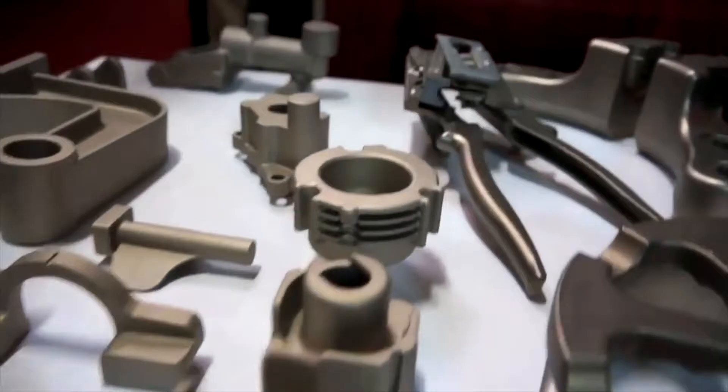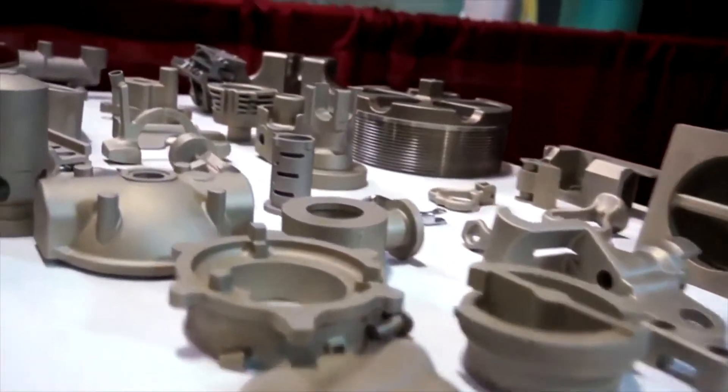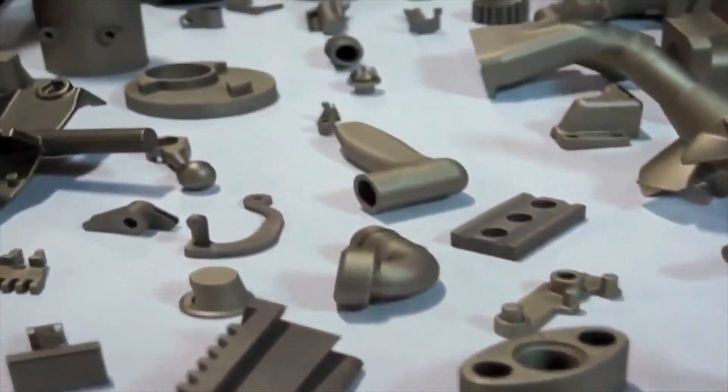We get much more detailed, closer tolerances and better finishes than sand casters get. It's a ceramic mold we're starting with. The first coat of ceramic that we put onto the part is a very fine detail — it picks up all the details in the wax that we coat. We've had instances of tools transferred to us because other foundries have been unable to do it.